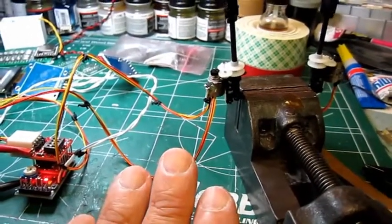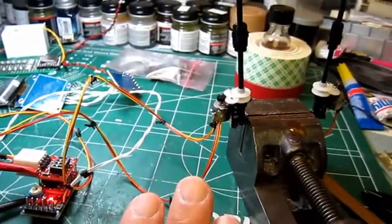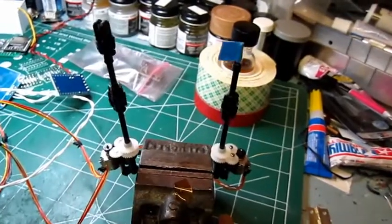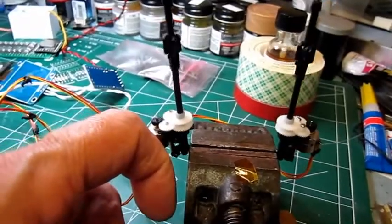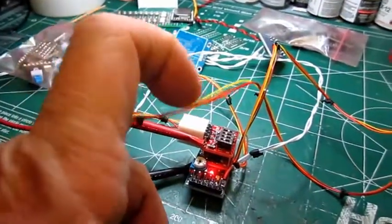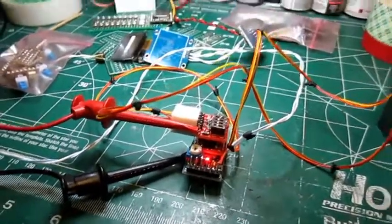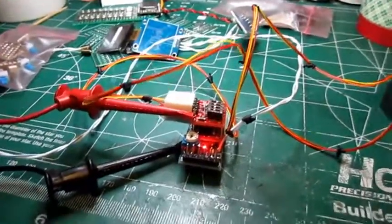They should be somewhere around — these I think are 16 ohms — not positive, but anyways, you're going to have to just kind of do some research and some reading up on these things. They should not be getting hot. Mine do not. I think maybe it's a combination of the step format and the voltage you're sending in and your voltage reference on the step sticks. So give that a try, and hopefully you can get it figured out. It's a nice effect, but you've got to learn a little bit about this stuff if you want to use it.